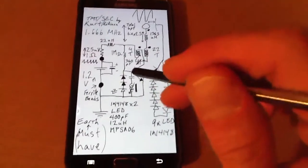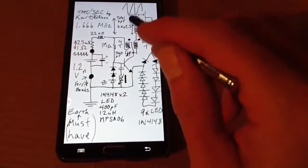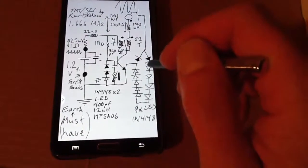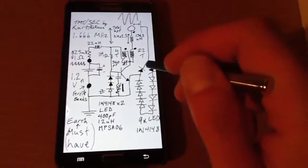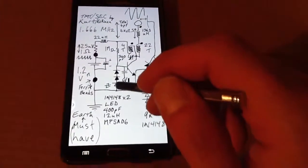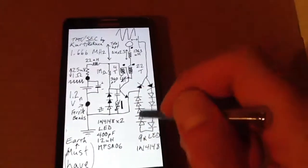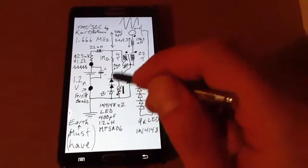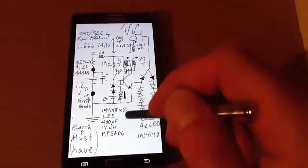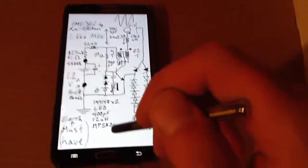And this is the waveform on the output, and you can read the same thing all throughout here. And that indicator LED is the one that kind of dims when these pick up and picks up when these go dim, indicating that there's some kind of added stress when it's out of tune. And earth ground, that was critical as well.